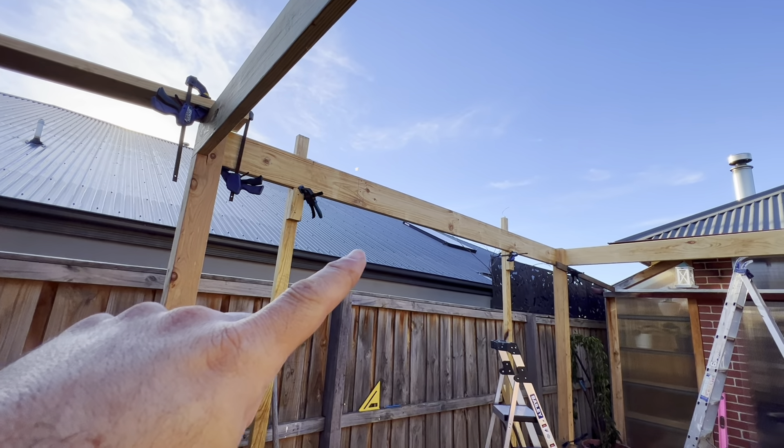For this next step, we're just going to put a block on the clamp and lift that beam in place on both sides. Over here I've already done that and screwed it in with some bugles. This area is going to end up having all the decorative panelling. The plan is to potentially leave the other section open — I've put three joist hangers for three beams, but the wife might want that area open. We'll see — I can always rip those out. I'm keen to see what this top section looks like with the panelling.